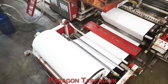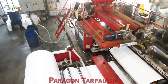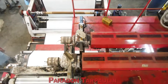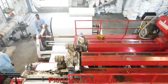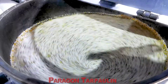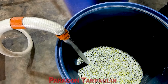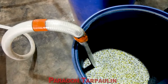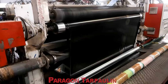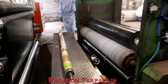The second process involves lamination on unlaminated woven fabric, a tarpaulin roll. We convert this unlaminated fabric into a laminated fabric with the use of virgin granules called LLDPE and LDPE. These granules are mixed with color master batch and some percentage of calcium as per the customer requirement. This mixture is then transferred into a highly advanced extruder coating machine, which gives it proper bonding to provide the finest lamination on fabric.